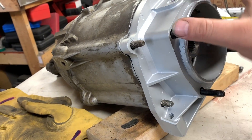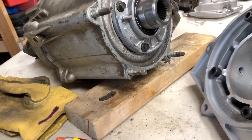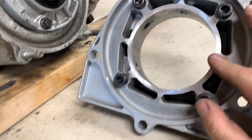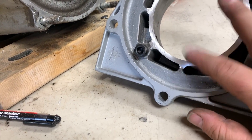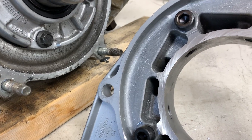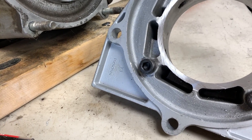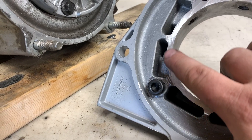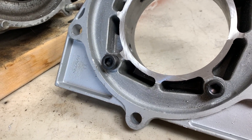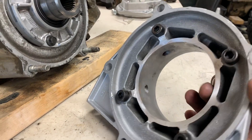It fits flush now, no interference fit inside there, so we're good. I want to keep this video short because someone has probably tried to do the same thing and couldn't make it work. Now if you don't have a milling machine, you can still make this happen — you'd need an aluminum die grinder burr. It'd be tricky; you'd have to put it in a vise, take your time, and start grinding it down, but with a die grinder you can make it happen. It doesn't have to be perfect — no one's gonna see it.